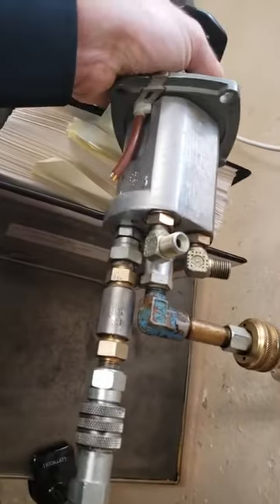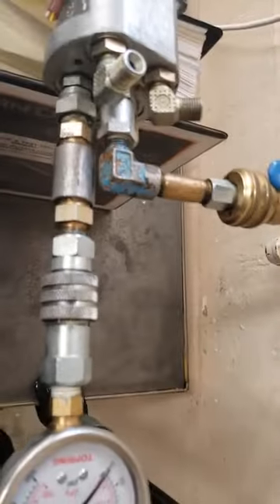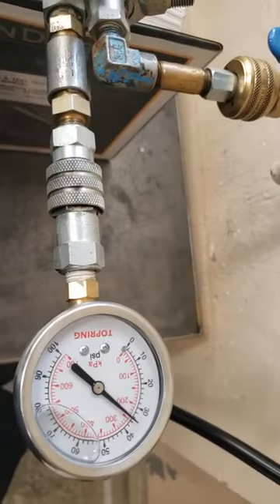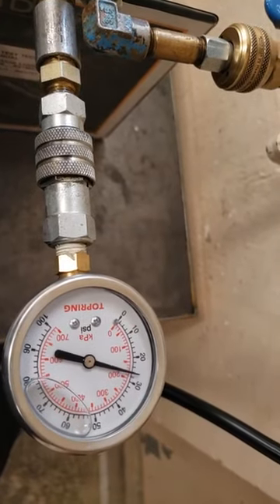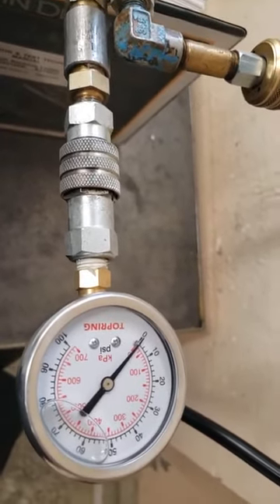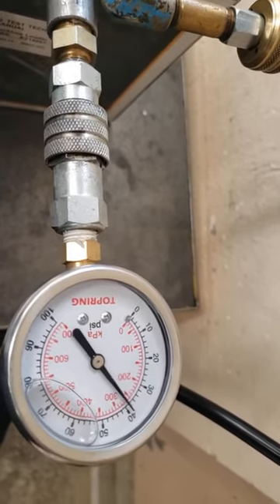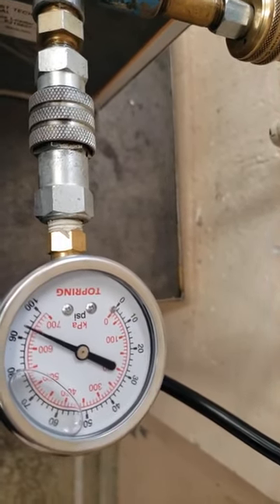They've put a little bit from P to T, but this is still a closed-center valve. If I operate any of the plungers, you can see I can vary my hand movement and very accurately control the pressure. If I want to build 30 psi, I move my hand a little bit until the gauge reads 30 psi. That 30 psi is pushing back on the metering stem against the metering spring, closing the valve back off and just maintaining that downstream pressure — so this is like a pressure reducing valve. I can set 40, 50, 60, 70, 80, 90, right up to full pressure.